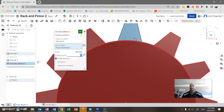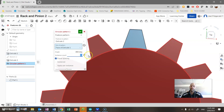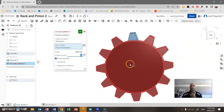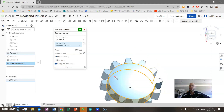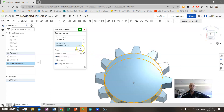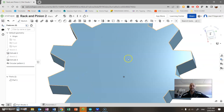What you need to check is that the negative space between teeth should be roughly the inverse shape of the tooth. If I go 13 it might just fit — probably a bit tight — so I'll go with 12, and that looks about right for my tooth. One last thing: tick 'Apply per instance' — this ensures it generates a solid and joins it for each instance. Click the tick to finish. There's the main body of my pinion gear.